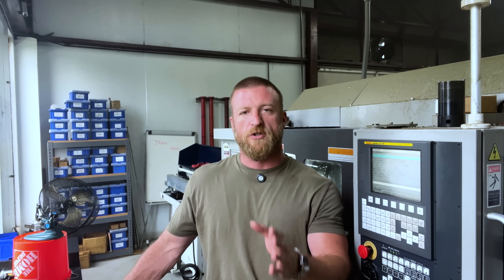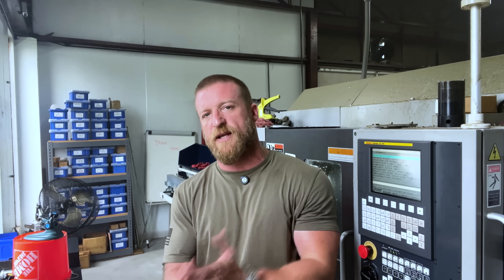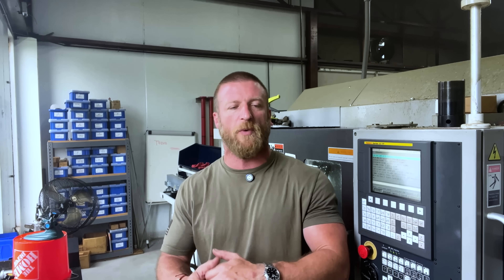That will be a great start, but it's just a starting point. Going back to the 431 — 1/64", 15 thou: one-third nose radius minimum is five thou, two-thirds maximum is ten thou. That is a loose rule. You might find that when you feed at 11, you get a wonderful surface finish and your chip is flying off — keep it at 11. You might find that at five thou you're getting great chip control but your RA on your profilometer is a little high — kick it down to four. But make a note, mental or on paper: for example, 1215 one-inch round, this geometry, this branded tool, this surface footage, this feed rate to achieve my goal. The next time it comes up — a month, a year, two years, or when you're training someone — you're going to have that information. That's the key.